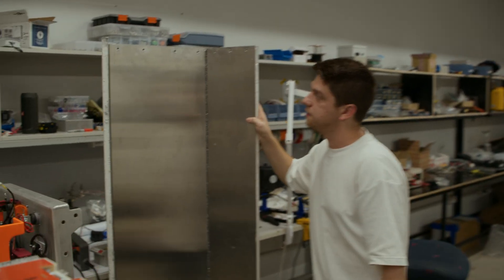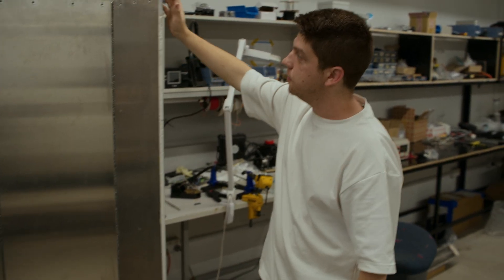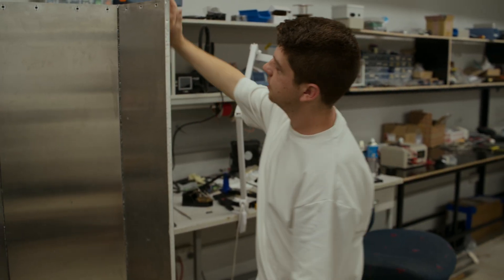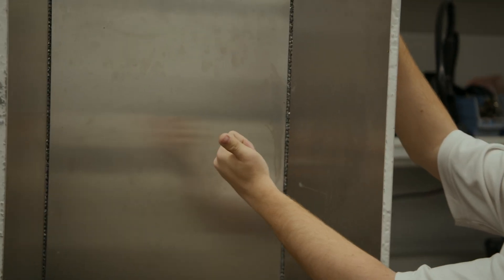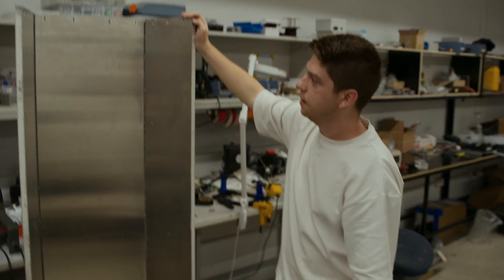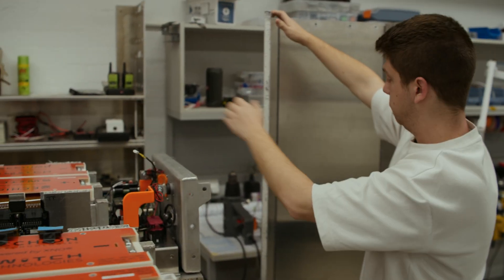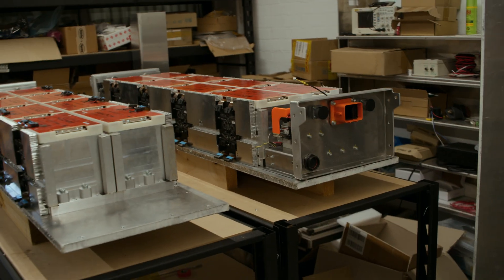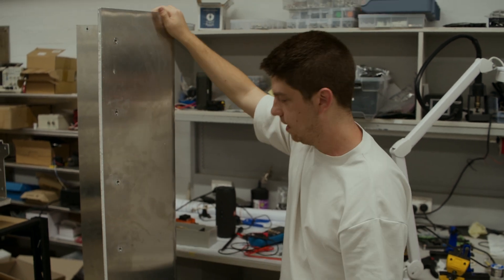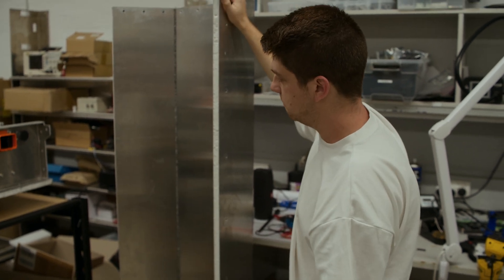It's a single piece that we've routed out these corners in and folded it up. The original intention was that this could be folded before it gets installed. We could not get the springback to stop breaking either an epoxy bond, then we put some aluminium strip in there — again, failed. But we're really confident that no matter what, by the time this gets bolted through the two end plates and bolted the entire way down the side with all these inserts, it will not move. The actual bend doesn't need to be structural because it is held together in three other locations.